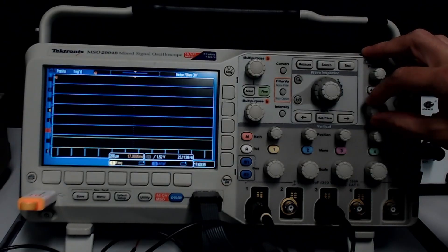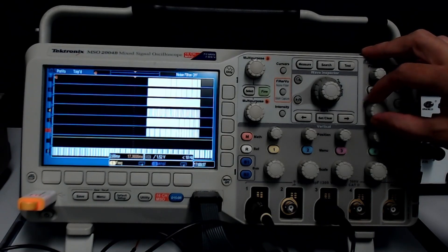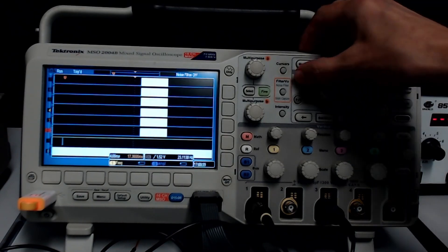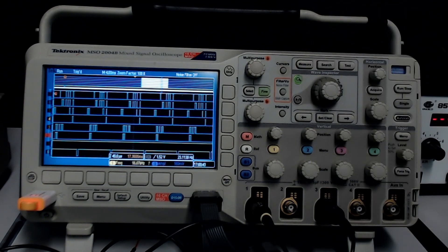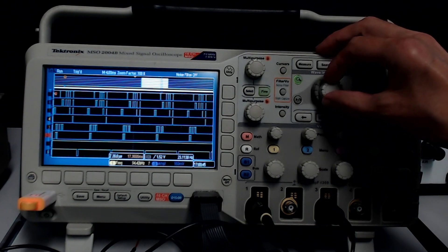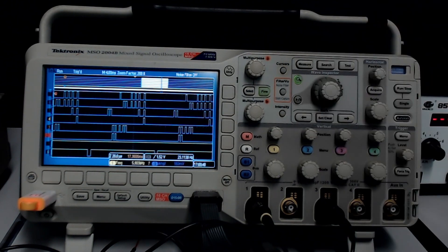Bring-up for the early silicon has been challenging. There are some scripts that help with that — you run a little test and it checks which IO pins can work and which can't. I got lucky on a chip for the clock and was able to get, I think, all of the pins working except one, which means the colors aren't quite what they should be.